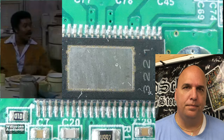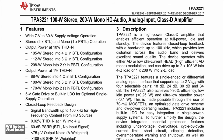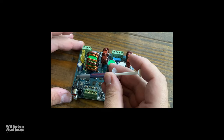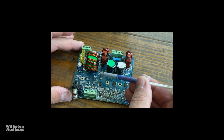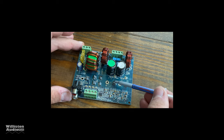Another thing I need to correct: the chip used in the Tar Amps is the TPA3221 — I was mistakenly showing the MOSFETs in the last video, so my bad. This amplifier chip is rated 100 watts by 2 at 10% THD, or 88 watts by 2 at 1% THD, but it has a voltage range of 7 volts to 30 volts — such a wide range, that's why it didn't do as much power. Thanks as always for watching — make sure you check the video description for links to all the products as well as related videos.